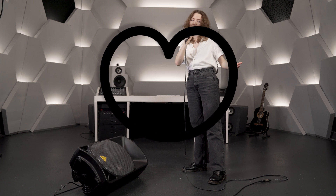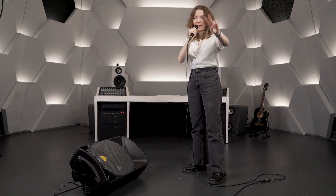You've probably noticed that pointing the microphone in a certain direction can be the cause of the issue. That would imply that the microphone is deaf from the back — and actually, that's the case with the majority of stage microphones. They use a so-called cardioid polar pattern. A cardioid pattern is sensitive to sound from the front and rejects sound coming from the back. If you wanted to draw this polar pattern, it actually looks like a heart. So there are two takeaways: first, if you are using a cardioid microphone, make sure its back is pointing towards the speaker to prevent feedback. Second, the polar pattern may change if you don't hold the microphone properly. Almost all microphones are designed to be held by the handle, not by the grill. If you grab it by the grill or completely cover it with your hand, the cardioid becomes an omni pattern and starts picking up sound from all directions — and then the mic screeches at you.